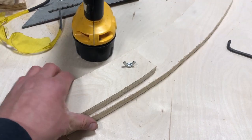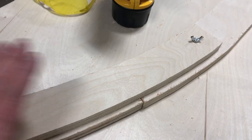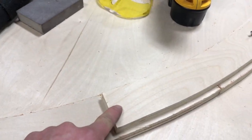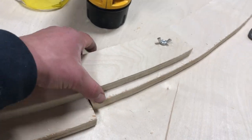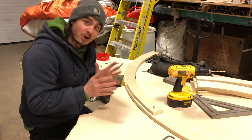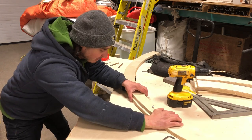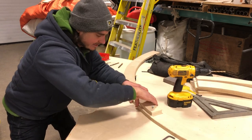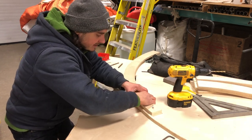You want to have the one nut in there. Now align this and hold it tight to the next body piece, then go ahead and drill all the way through until it makes some sort of indentation on the body piece underneath. Move this away, put in the nuts — the holes will already be drilled — then put the bolts through. This is really where the magic happens. You essentially put this together; you want one body piece tight against the next so the joint is as small as possible. When you flip it around you'll see the joint is relatively small — that's the idea, as tight as possible.